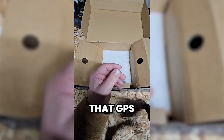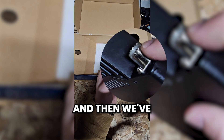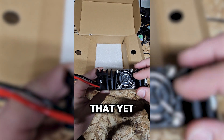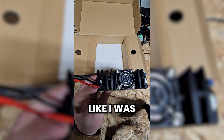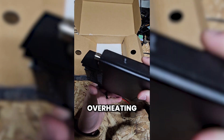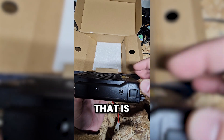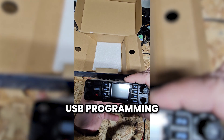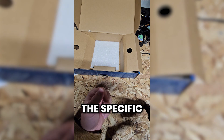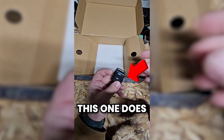There's the GPS antenna, which connects right in here on the back of the radio — a little SMA connector for the GPS antenna, and an SO239 for the actual radio antenna itself. This one also has a cooling fan on the back. These mobile radios putting out that higher power do tend to get hot, so having that cooling fan along with the built-in heat sinks is going to help keep the radio cool and prevent overheating. We've also got a micro USB port for programming — I like to see radios coming out that have USB programming and not a proprietary cable. Just keeps your options open.